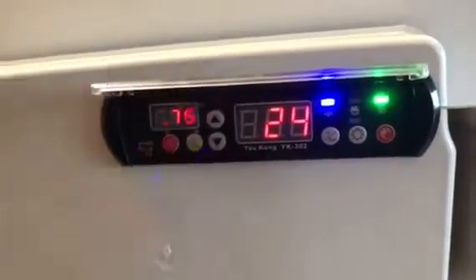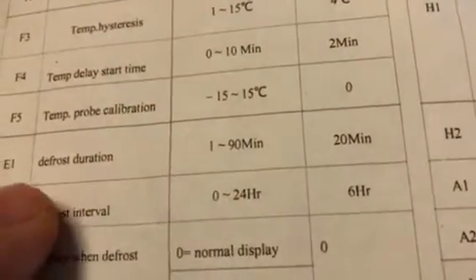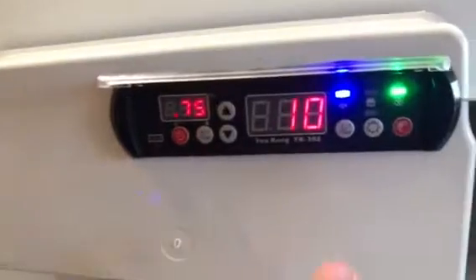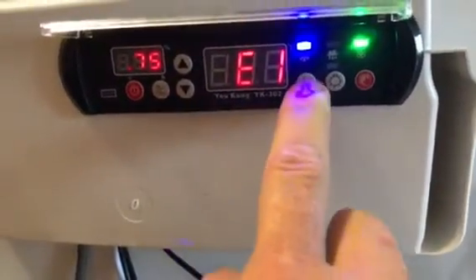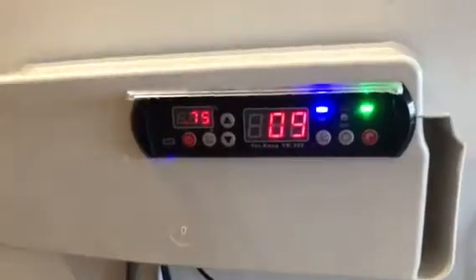Every 24 hours the machine will go into defrost mode. Now E1 is how long it will switch off - the default is 20 minutes. I don't even want it to switch off, but my minimum limitation is one minute. So every 24 hours this whole thing will go into defrost mode for one minute. Let's double check - E1 is set to one minute. You can't put zero, so every 24 hours this controller goes into defrost mode for one minute, which I can live with.